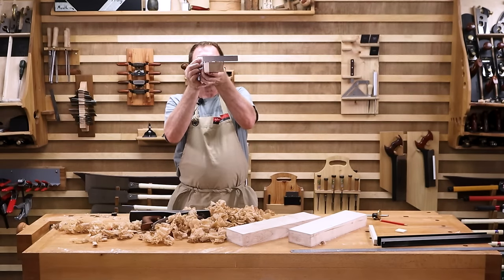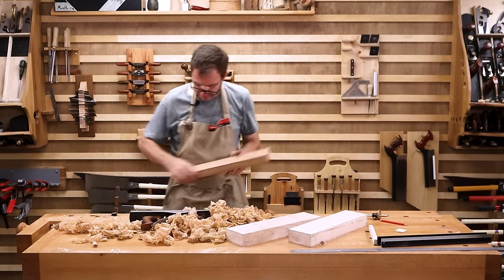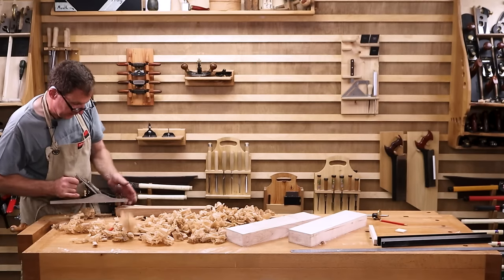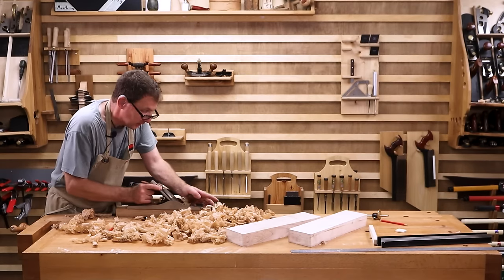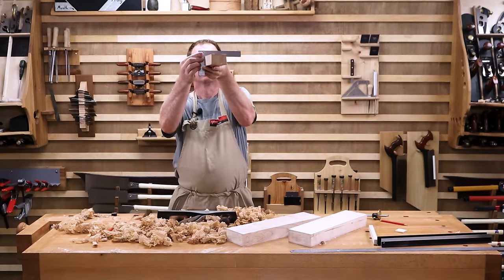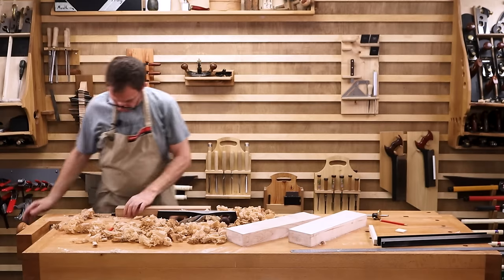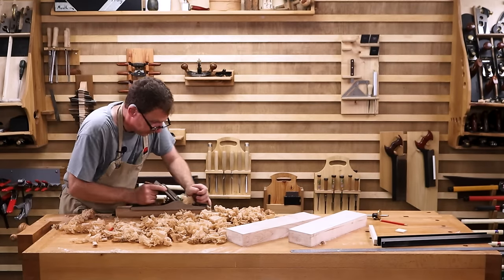I've still got high spot right hand on the corner, a little bit there. High spot left, okay. So I've got high over here, and then I've got to come across so we can come from there, take the shavings out, we can monitor. And there, gonna come across. Bring it down. Having done our shaving, let's have a quick look. Hold it up. Tiny bit, still not quite down to the line on that corner. So we're going to come back down through.